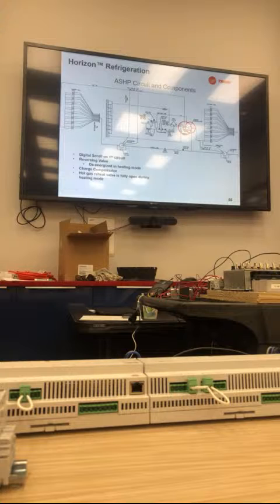So my tubes do this. So you're always pulling from the bottom and dumping in the bottom. Now I've got a receiver that no matter where liquid comes in or goes out, it's always pulling from the bottom itself. And our liquid line receivers are holding up about 10 pounds of refrigerant.